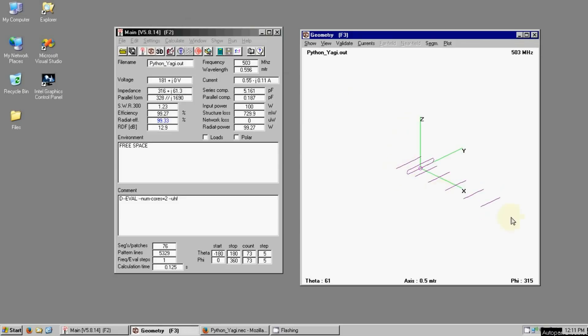The actual structure, the boom of the antenna isn't shown — it's just you model the individual wires. On a Yagi antenna, all these wires up front here are called directors, and this one right here with the loop is the feed point — it's a folded dipole. And then you have one reflector.